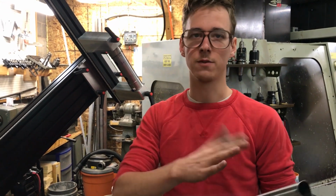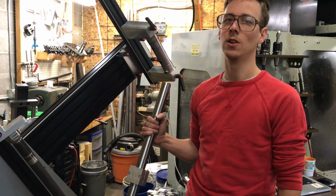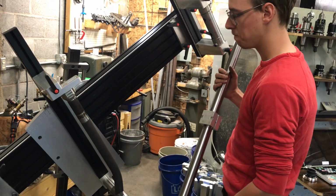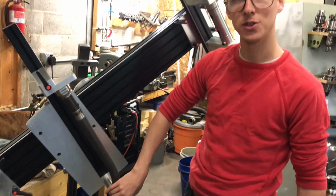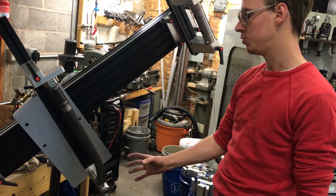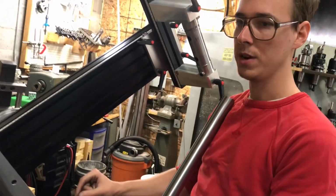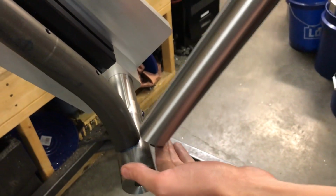And if it's too tight, then you're going to have to file it back with a hand file. So I think I'll probably just do the whole thing with a hand file. It shouldn't take that long. It's just walking back and forth to the bench vise a couple of times to work that in. And it's tricky because I kind of eyeballed these to be nearly tangential to the tube and not exactly measurably. That presents issues, because you have a small margin here as these come in together at a shallow angle. If you're off just a little bit, you're going to have a pretty heavy gap there, and I don't want that. So I think I'm just going to walk it in with a hand file and sneak up on it.